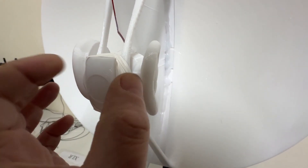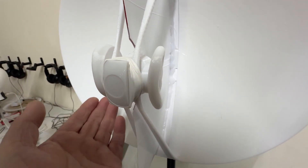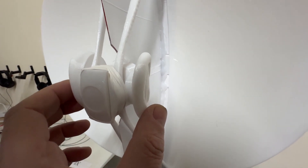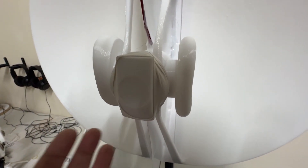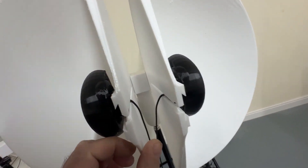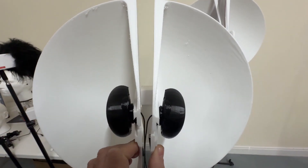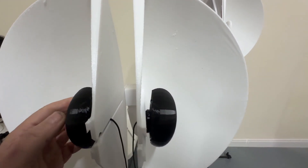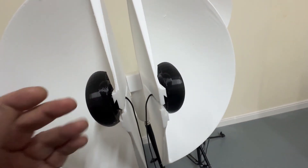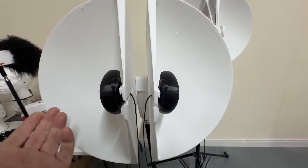Though the purists might think otherwise about ear spacing, the proof is in the listening. I can't disprove that the distances between the ears are vital, hence the tiny distance here. So I'm going to try focusing this - we can also change the angle or squint of this a little bit. Once I've found the ideal focusing position - whether with these cups on or off - the distance between the dish and the ears, and whether to move them in or out, all has to be adjusted and tested.